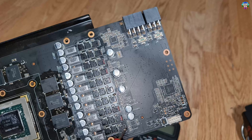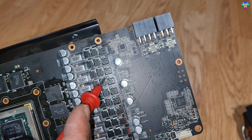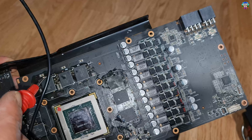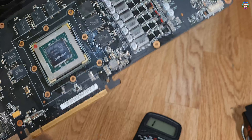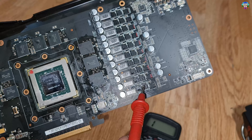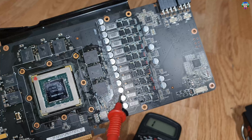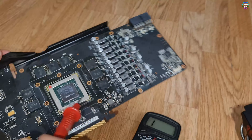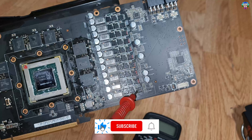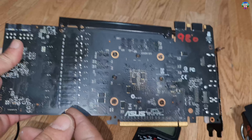These four drivers may need to be changed as well. My plan is to remove all eight MOSFETs. They are difficult to find in the UK at the moment, so I've ordered from AliExpress — they are coming from China. They're not too expensive, roughly one pound each, so I need about eight of them — roughly eight or nine pounds in total including delivery. Delivery will take about a month. This is a Part A video; as soon as I get the parts I'll make Part B, which will be uploaded after that.